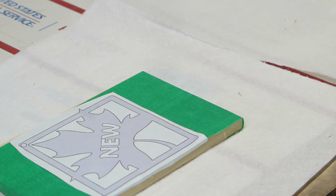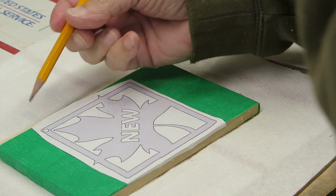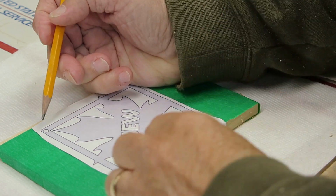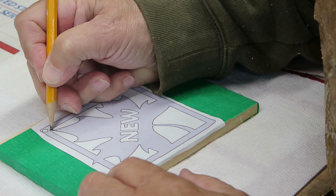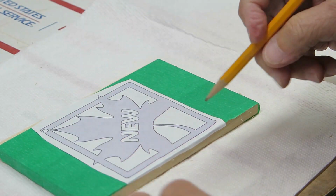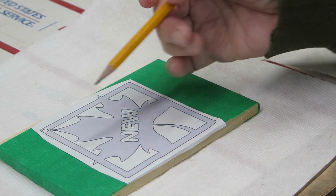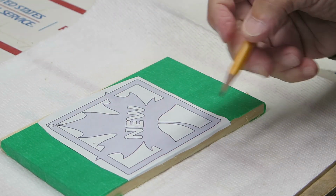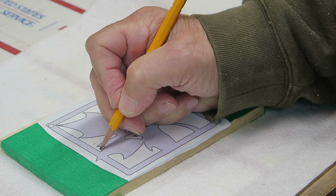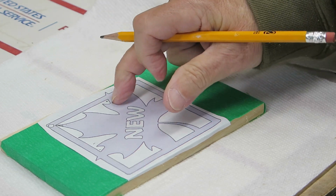Now what we're going to do is take this over to the drill press and drill some entry holes. This doesn't quite go to the top here, the leaf pattern anyways, but I'm going to imagine that it does when I cut this, so that I get a little extra support there. This probably wouldn't break off easily, but if you get that little bit of support up there, it might help. It means an extra cut, of course, but that's okay. So I would cut these out, probably starting at some point in here, right near the corner.